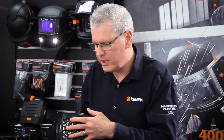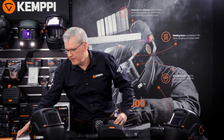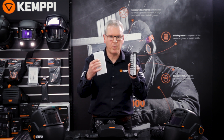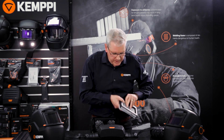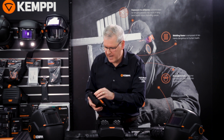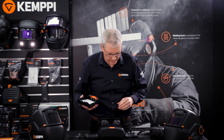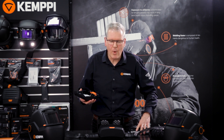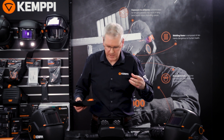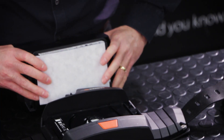Safe breathing air, but because we restrict the selection of the upper speed it just extends the life of the gas filter, because these gas filters are obviously a lot more expensive than the standard particle filter set. But if you need a gas filter you obviously need a gas filter set, so that expense has to be borne for adequate protection within the workplace. You always use pre-filter and particle filter, but you also have to use that combined filter set with the gas filter as well.